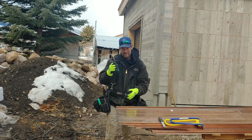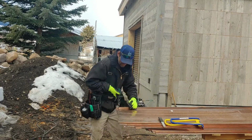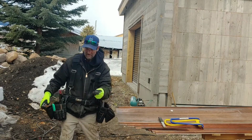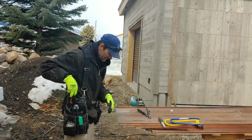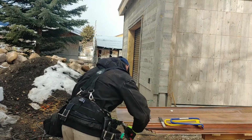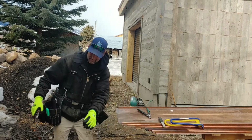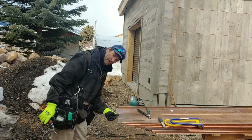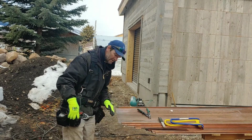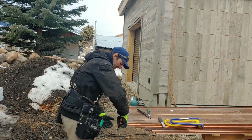Then you need left-hand snips for one side. Remove that, and then you need a set of right-hand snips. Then, because it's copper, the guillotine kind of folds this over funny because it's softer metal than steel, so I have to trim 1/4 inch off of this.